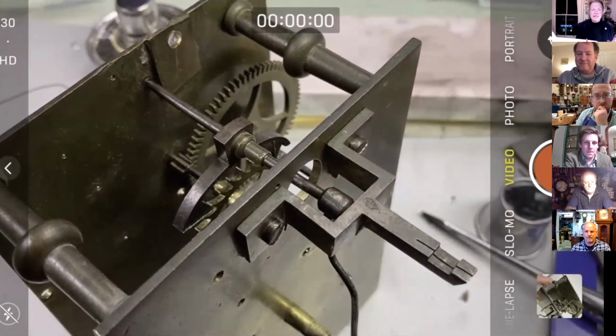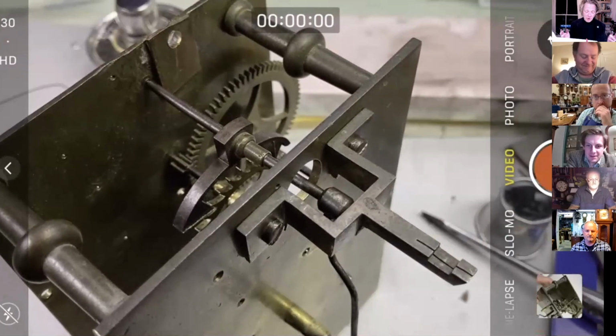Our new pallet face is hard. We polished it up with that stone. On many or most of the teeth, we've got a good amount of internal drop, but we know that on some teeth, we've got no internal drop. So there's a problem if you think of it that way. I don't actually think of it as a problem with the escape wheel.